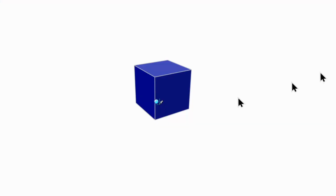After a quick remark on Twitter, I decided to make a sanding bow. Now, a sanding bow is a great little tool to smooth out 3D prints. Printed the first one, way too stiff. So back to the design board, did the calculations, calculated the flex, tested that flex, and printed the final version. Here it is. Let me show you how I did it.